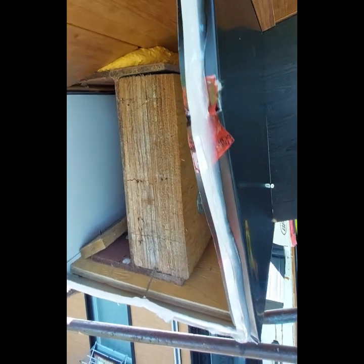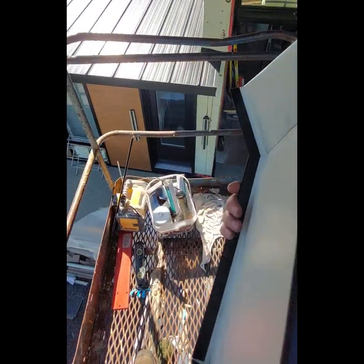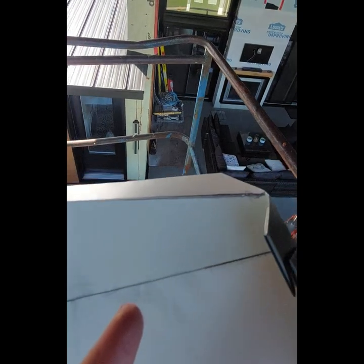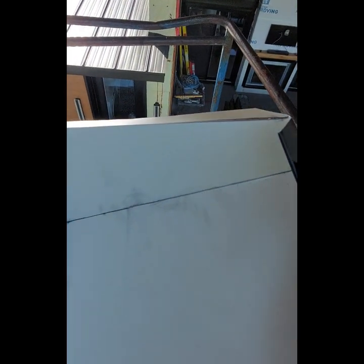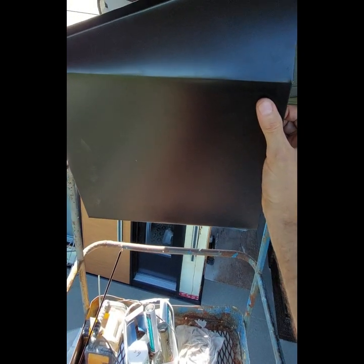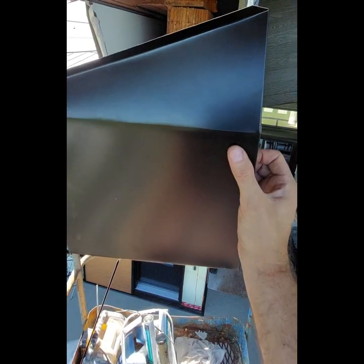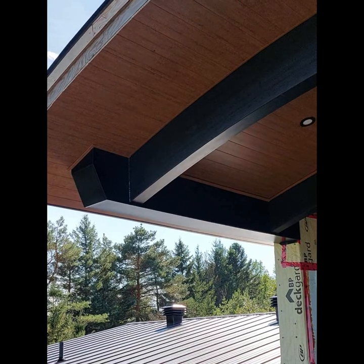Here's the end cap ready to go — I put some two-way tape and leftover translucent caulking on the end and I'll just slide that in place. I made a return lip on the top where I'll put a fake wood trim finish. To achieve a crisp bend inside a box, I like to take an X-Acto knife with a square and do a light score on the back to create a weakness, then fold it using the square — that gives a crisper straight line rather than a round edge. I'll use both hands to slide it on straight to avoid it going crooked on the two-way tape.